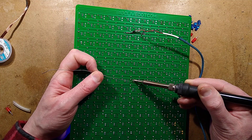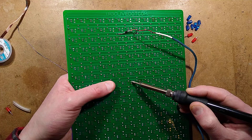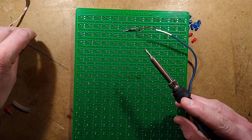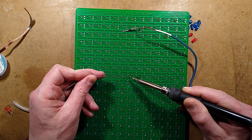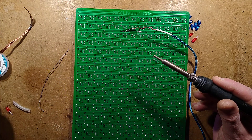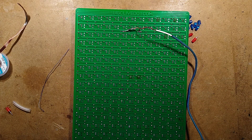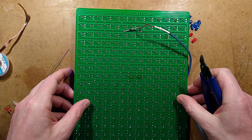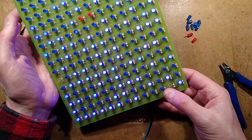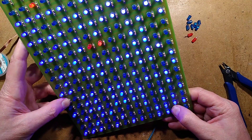There's also this image that the computers in sci-fi sets were just blinky lights — that was just the classic image of computers. What I'm thinking about here is that I'm using a switched-mode power supply that's not earthed, so sometimes you get a voltage with reference to ground. Because the soldering iron is referenced to ground, it could actually be upsetting some of these LEDs — though I doubt it. I've got one more LED to put in over here and one over there, which should bring me up to date with the repairs.